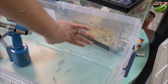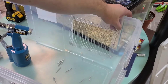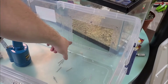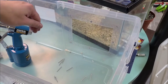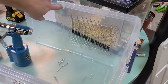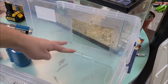Now that that's done, this is installed. Do keep in mind the mesh is on the inside and the rivet heads are on the inside, because we're trying to hold the mesh in place and block rodents from getting to this edge and being able to chew their way out. It is secured all the way around with no gap large enough for a rodent. Tomorrow we're going to cover chew-proofing, because there are ridges here that we have to cover up so rodents can't chew through them. Let's finish this up.